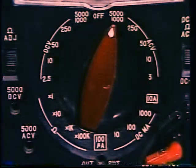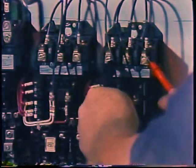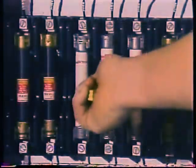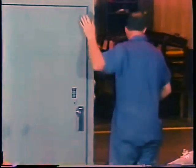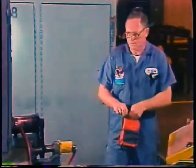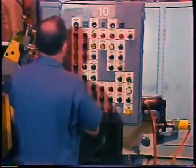So first, check voltage to make sure the breaker is really tripped. Then take a resistance reading on the lines out of the main box. If the resistance is high or infinite, you can replace the fuse or reset the breaker. Be careful here — even though you are pretty sure you are not switching power onto a shorted line, stand to one side and look away. If the fuse or breaker holds, you can eliminate the lines to the starter and the input side of the starter itself.